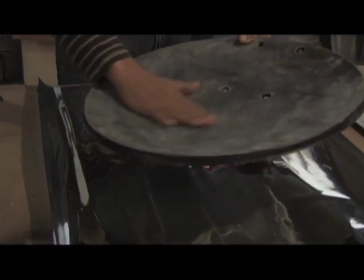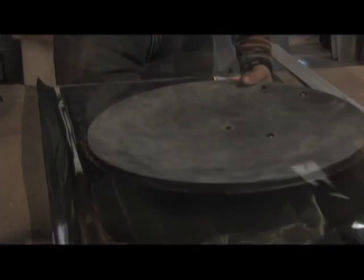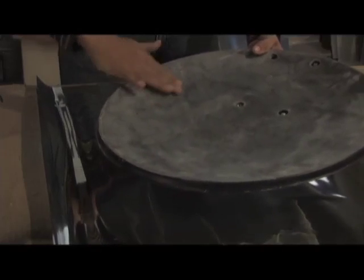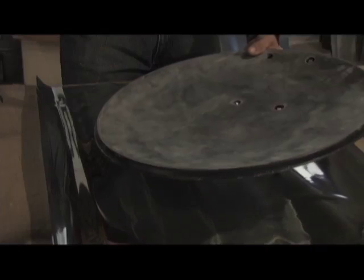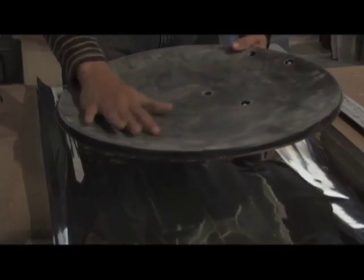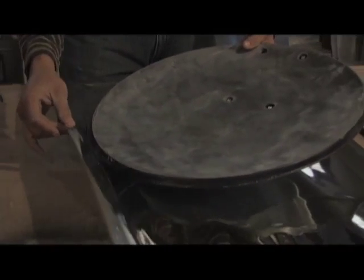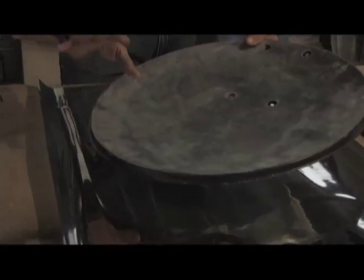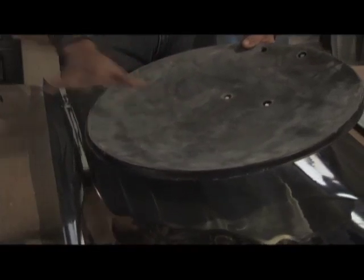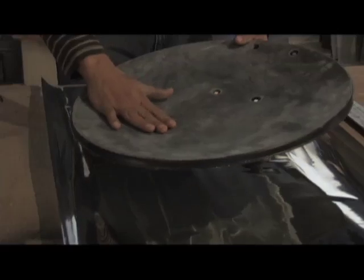You don't have to go down to the bare metal, but it's a good idea to go down to where it's very smooth. If you don't go down to the bare metal and you just leave the gray surface on there, take gloss black paint and put a couple of coats on so it has a nice gloss black finish — it acts as a great backer. You can use silver, but the lighter you go with the background, the lighter you'll end up and the less of a mirror you'll get. So gloss black is best if you don't go all the way down.